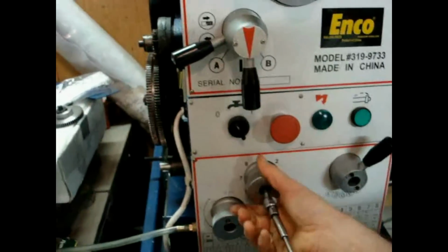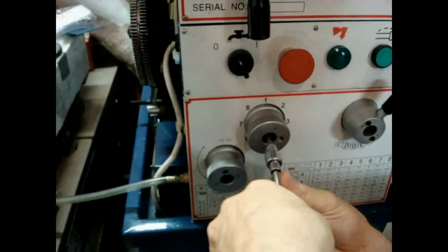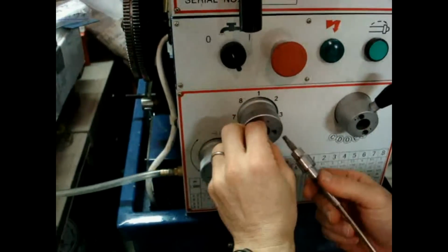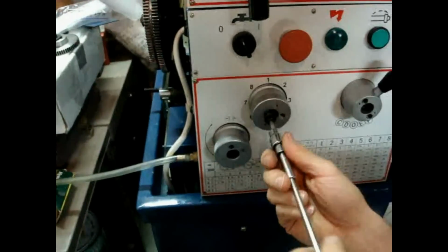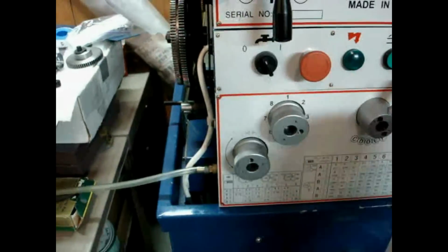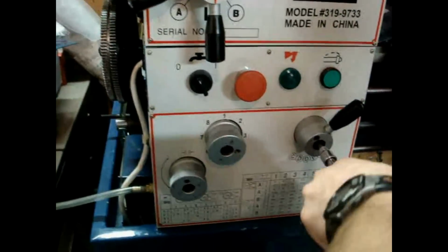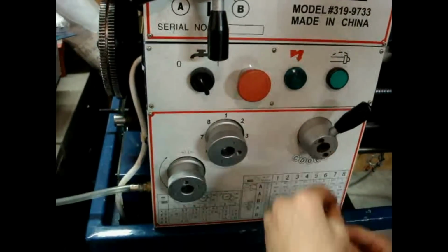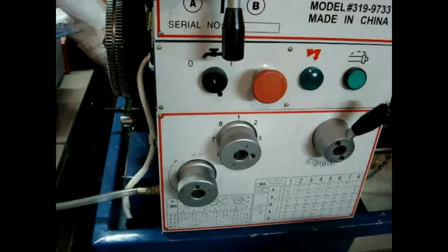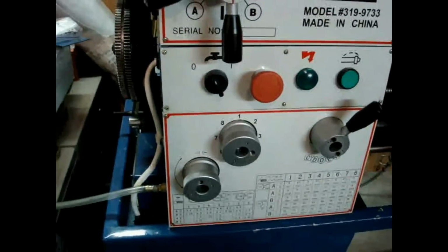Once you pull the springs out, you could actually do this first if you'd like, and then it wouldn't turn quite as easy, but they're just detent springs, those springs and bearings that we pulled out there, so it will still rotate. There's that. Now, the next part requires some sort of gear puller.